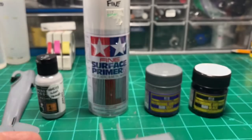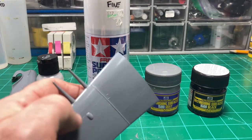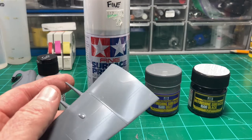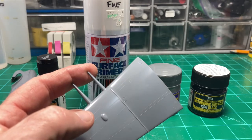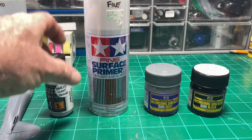If you're painting with metallics, those discolorations are really going to stick out. If you're painting with a thin gloss, it's going to stick out. So another benefit of priming is the priming is going to cover that up and you're not going to see it. Speaking of priming, I told you I'd be telling you a little bit about the primers.